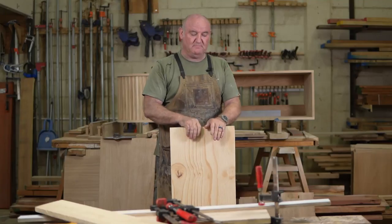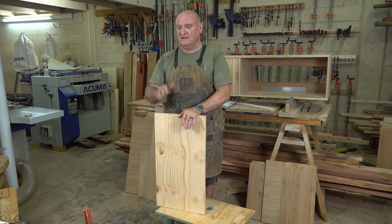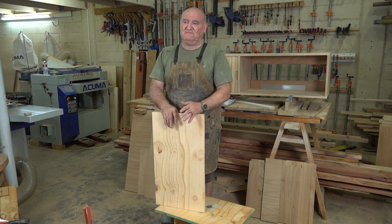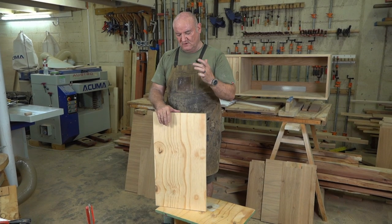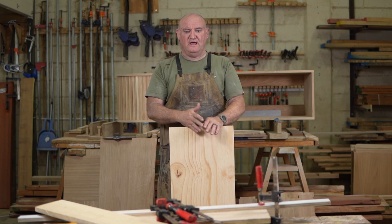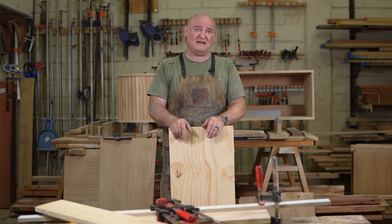The moral of the story is that you don't need a big power saw to cut plywood. It probably took me under a minute to actually saw that piece. A decent saw, plus a decent guide or cheat fence, and you can definitely get it done. Don't be disheartened if you don't have a circular saw — you absolutely can cut plywood by hand. Make sure you know where your lines are, use a combination hand saw, and invest in a nice long saw — they're not that expensive and are very useful.